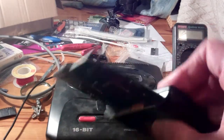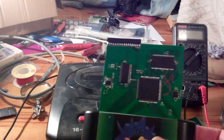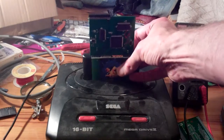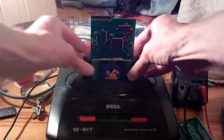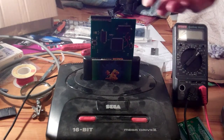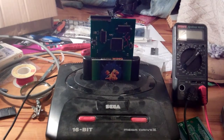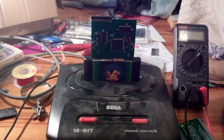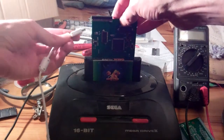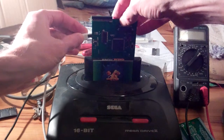There's a boot flash as well for the FPGA which has a spare 128K, which I hope to use for the monitor program and menu program when it boots up. So when it's finished it will work in a standalone mode - if you just turn it on you'll get a menu of all the games on the SD card displayed on the screen. But if you actually want to use it for development then you just plug in a USB cable and you're off.